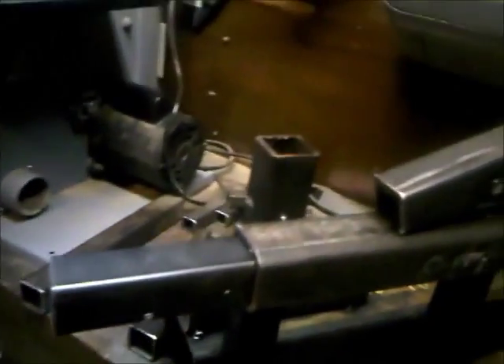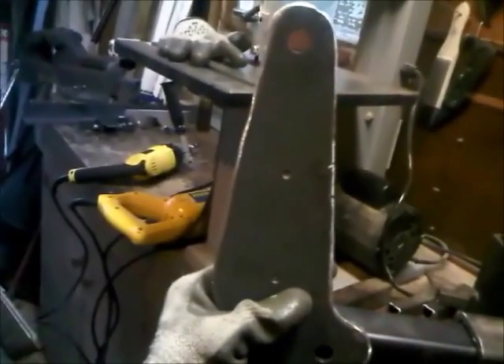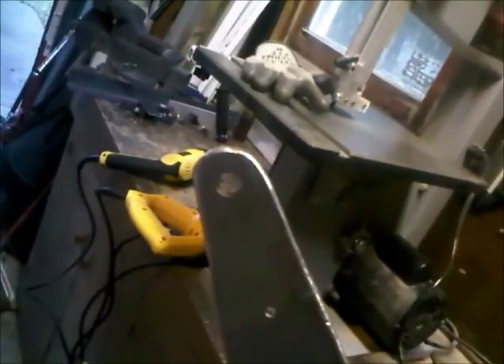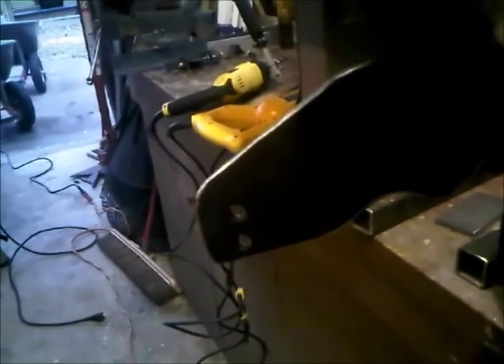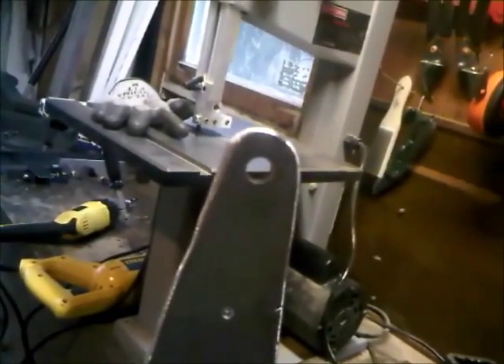One of the tool holders will slip in there — there we go — and then this will go on somewhere like that. In this position you'll have a flat platen presented. You can tilt it out and get a small two or three inch wheel, or tilt it the other way and present an eight or ten inch wheel. Which hole you use depends on which wheel you pick. So you just rotate that around to present the grinding surface you need — either a platen, small wheel, or larger wheel — without having to take everything apart.